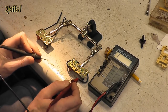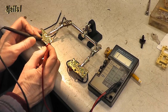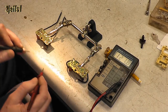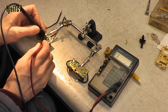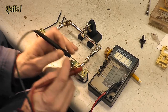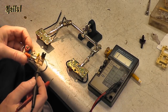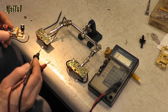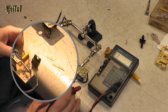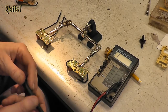So let's go to the Triac. And we're reading on him and he says he is not turned on. And this one here is. So let's check out this guy right here. And he's reading a little higher where he shouldn't be. The reading on this is different. So I'm going to lift the solder, and we're going to pull one of those pins so I can lift it off the circuitry. That'll narrow the issue — is it this guy here, or the Triac? So let's find out.